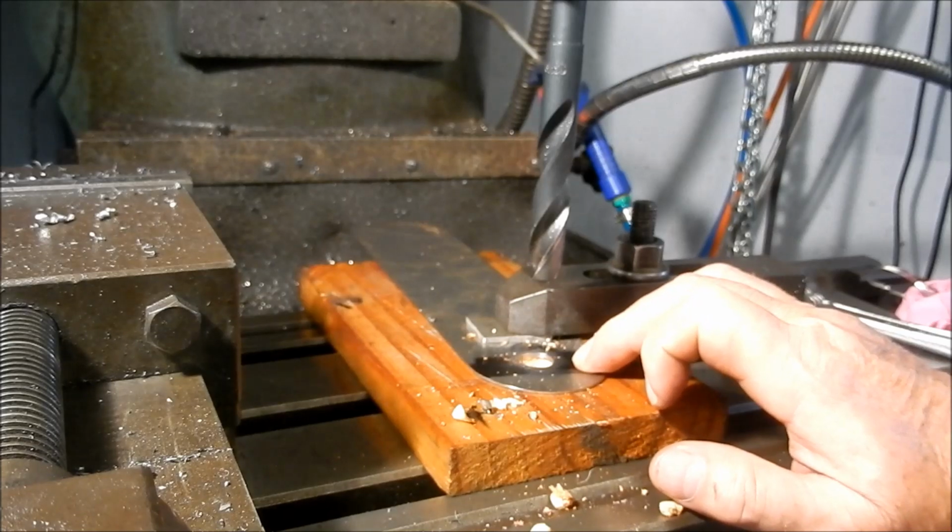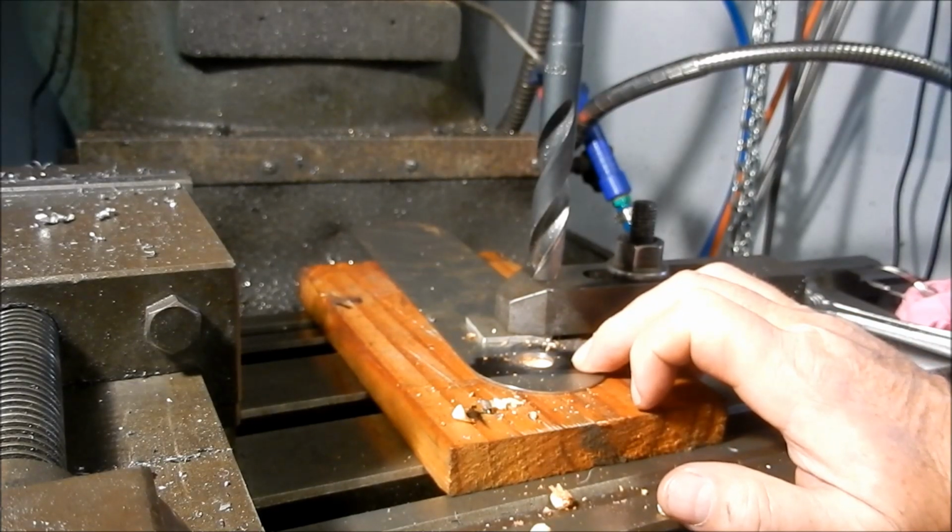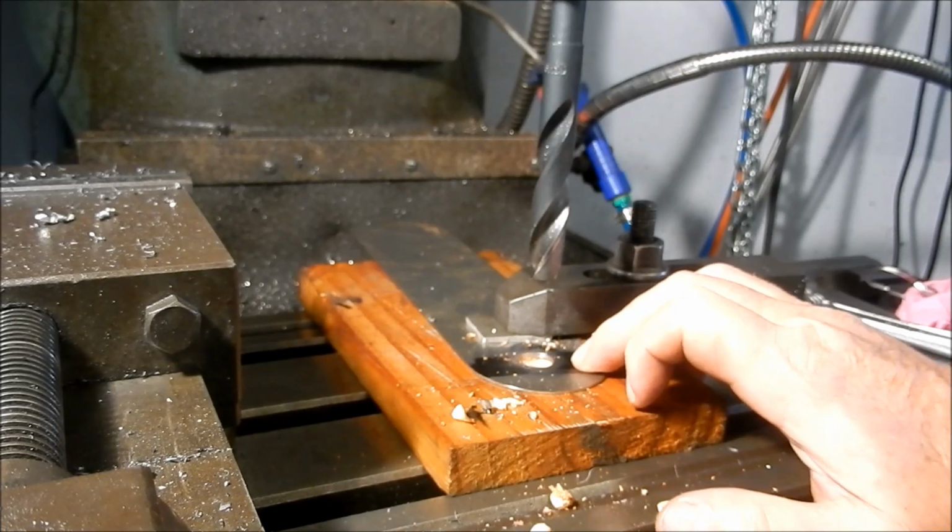Right, that's all done. I'm going to get this all clamped together and over to my brother's, where we're going to get the whole lot TIG welded together. I think we're going to bronze weld or bronze TIG it, so that we minimise the thermal load on it. Try and get the temperature down, and we'll see how we go. Alright guys, we'll see you soon.